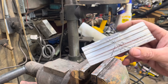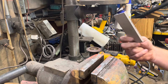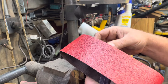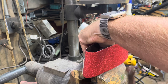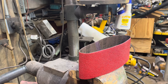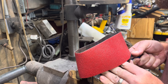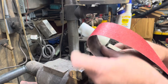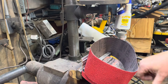I had an X-Acto cutting box and I cut off the other edges. I got a block of aluminum that's a half inch thick, set it in here — the block isn't even square so I have it marked as an outside — and then I clamp it in my vice. I take my utility knife and cut from the inside, because cutting from the outside would chew up the blade much faster. Just cut through the paper on the back side, release it, slide the belt down, make sure it's always flat against your edge, then press back in.